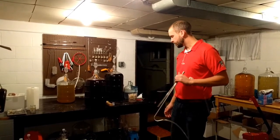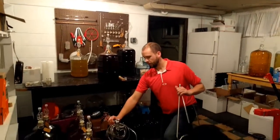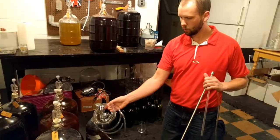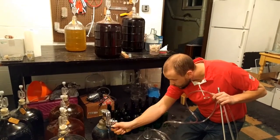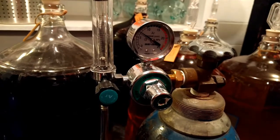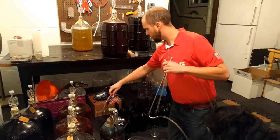What I'm going to do here is just take my argon tank — I've turned the valve on — and I'll set the flow rate really slow, down to about one liter per minute.